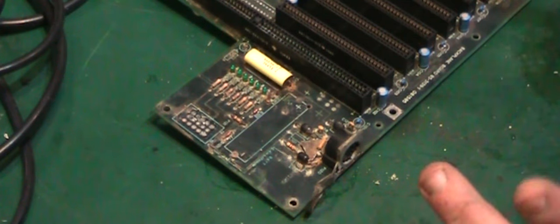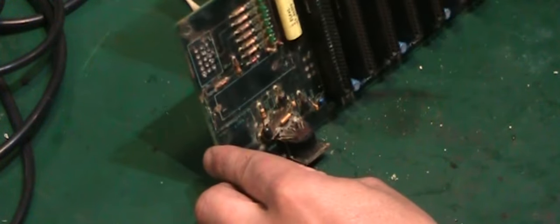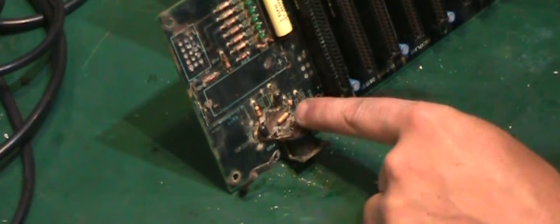Right, okay, well I've got the little ultrasonic set up. I thought before we start using that and stick the connector in it, let's get that DIN connector off, and we can stick that in the ultrasonic at the same time. Now, what I'm going to do before I just start whipping that off there, because they obviously made some kind of mod, you know, like in-house mod, and I think one of the pins on this is lifted, and we've got a diode across it.